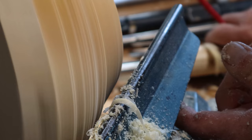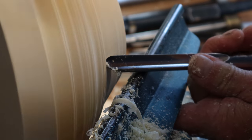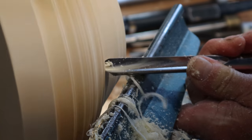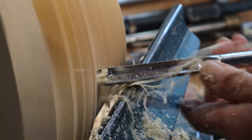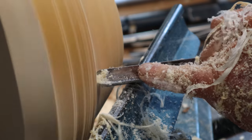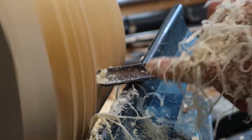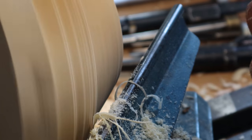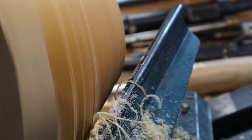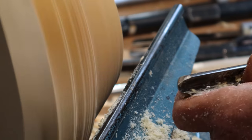I do that with a spindle gouge — this is the conventional half inch spindle gouge doing much the same thing. The point of the cut is quite a long way from where it's sitting on the rest, so I can feel the tool isn't really strong enough for that on this size bowl. Which is why we have the deep fluted bowl gouges.